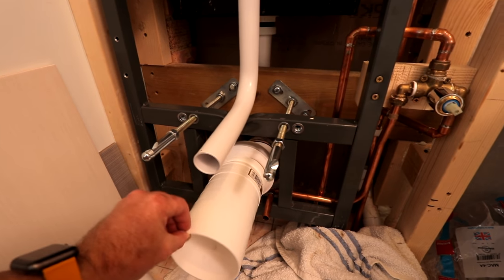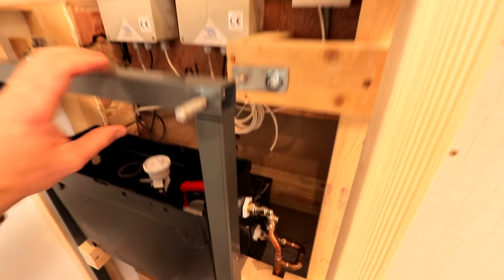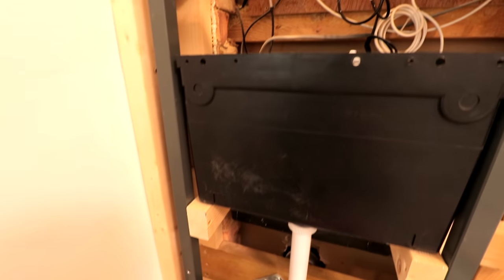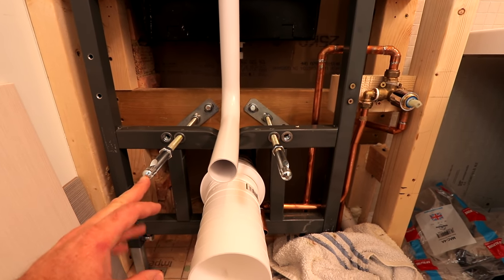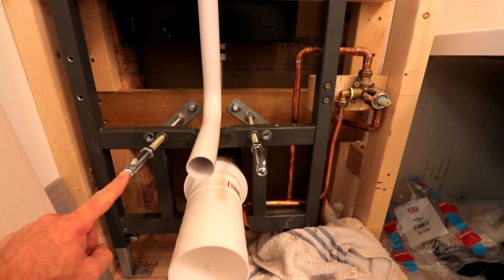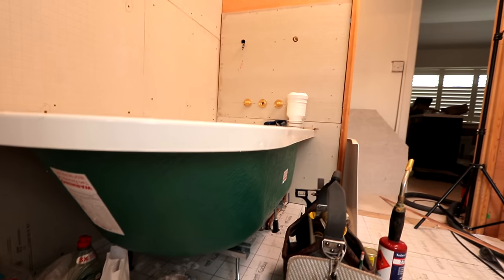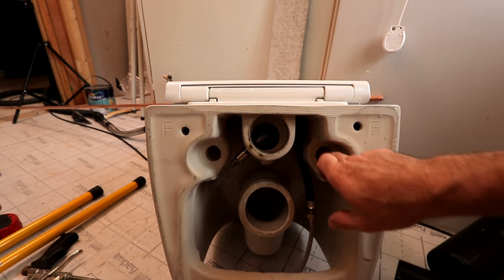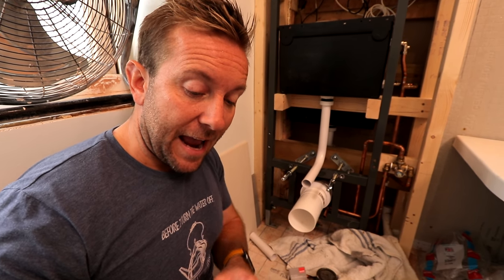I did test the fill up on that. We've got our waste pipe in. We've got our flush pipe in, we've got everything on the back here. It's really well fixed down. So what I want to talk about is these two points here are fixed points for our toilet. For us to know what height we want this to be at, we should measure from these fixed points here on the toilet down to where the waste comes out on there. We can do that on this toilet, because the toilet is here. We can measure across from here, down, and then find out exactly where we want the top of our waste pipe to be.